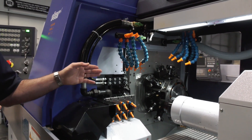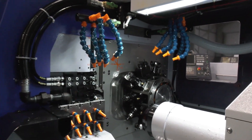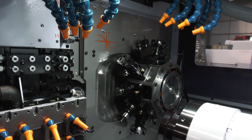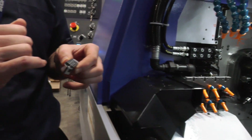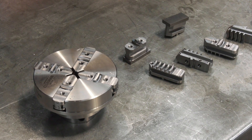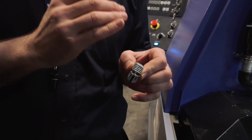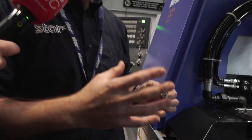As you can see, we've used some very specialist tools in the turret. We've got four customized tools going up to 75mm diameter to manufacture the scroll - the teeth on the actual jaw itself. These jaws are manufactured in sets of four and the pitch of the scroll changes for every different jaw, which we cater for in the program with a couple of macro variables.